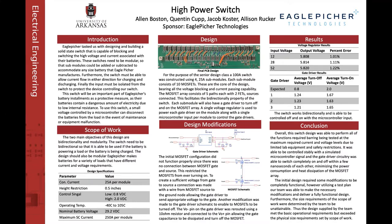For our senior design class, we built a 100-amp switch constructed using four modules. Each sub-module consisted of five paths of MOSFETs. Each path contained two MOSFETs with the sources connected to allow bi-directionality. Each sub-module also has a gate driver to be able to turn on and off the MOSFET array based on a microcontroller input. A single voltage regulator is used for all of them to power the gate drivers.